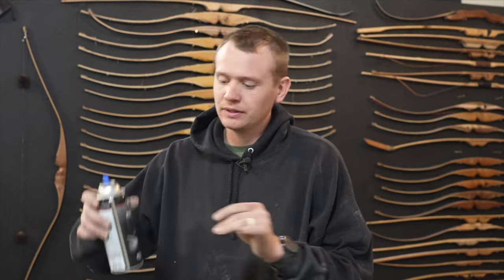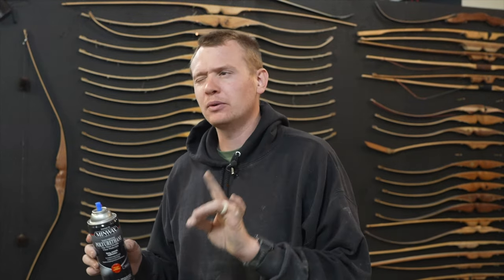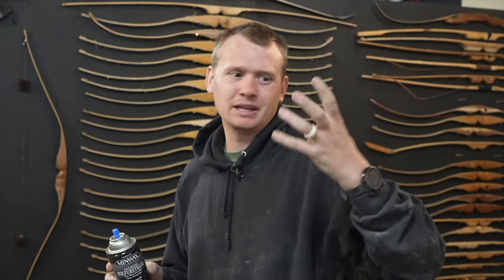Now that the bow is sanded and ready for a finish, let's talk about what to use. If you don't have a spray gun, you can totally get a $10 can of polyurethane and use it to finish the bow and get a great finish that'll last three to five years. The part that'll wear out first is right around the handle from sweat and hand oils. Cabinet finishes and hardwood floor finishes also do well. A common misconception is that the finish will crack with the bow bending. I've tried over 10 different finishes — water-based, oil-based, rub-on, paint-on, wipe-on, spray-on, penetrating oils, and finishes that stay on top of the material — and not one finish has ever cracked on me when the bow bends.